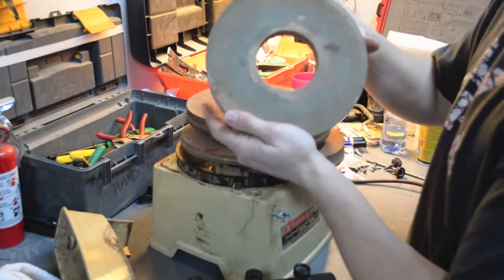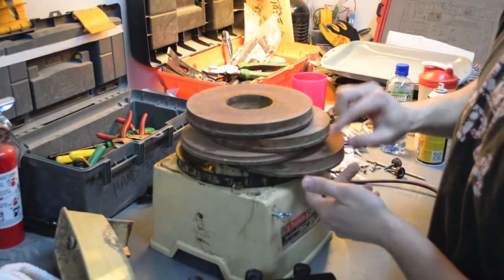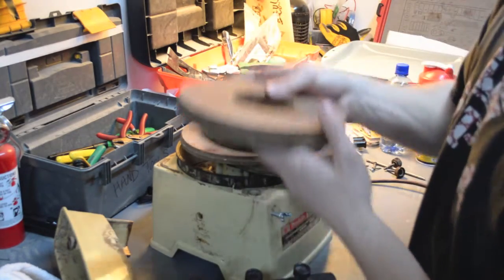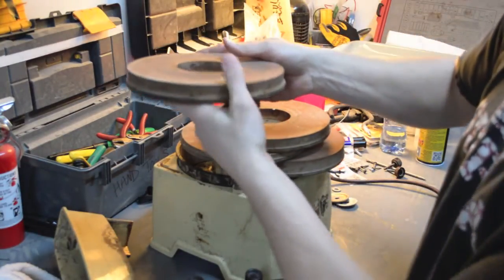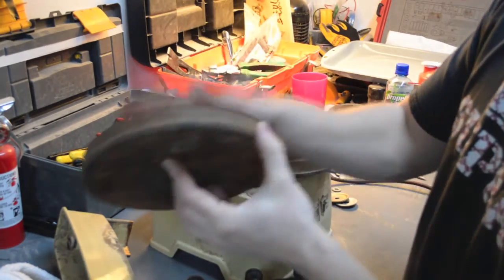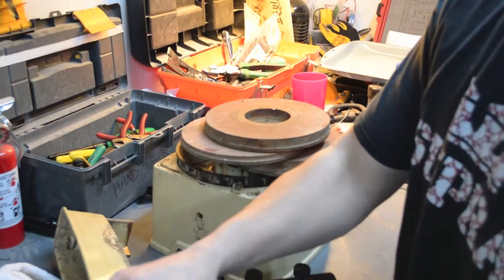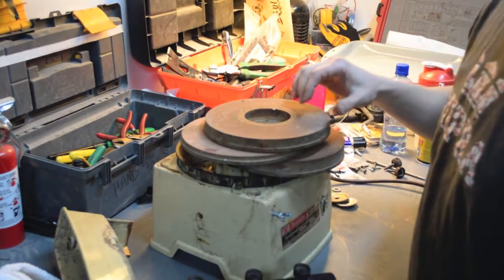And then this green grinding wheel, but it doesn't have a base. But I think what I'll do is probably steal one from one of these 1,000 grit stones. I have 3 of those, and there's no way in my entire lifetime I'm going to use all 3. Especially the one that's really in the worst shape and probably the thinnest of the 3. It's pretty far out of true and flat and level. And the base is pretty nasty, so I'll probably try to chip that off somehow, and then epoxy that on, or maybe silicone it, and try to mess around with that for grinding things that need a much coarser grinding to take off more material.